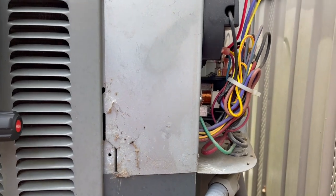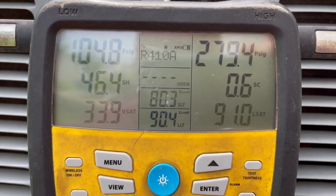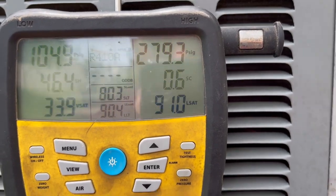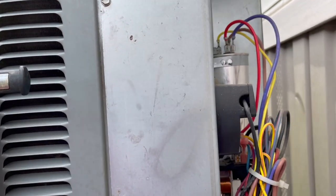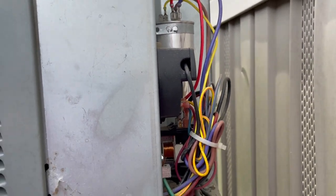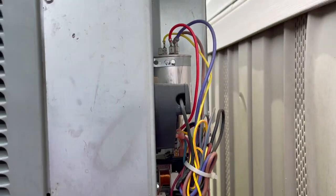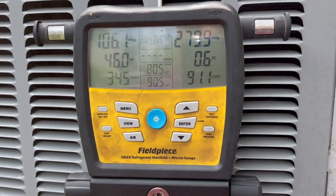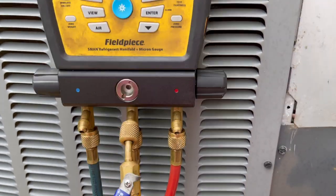The machine is running. We're a little low on gas. You can see we've got high superheat, no subcooling, and low suction pressure. I'm going to check that capacitor because it is a Chinese capacitor. This is a 2016, so this unit's about five years old, so that capacitor is probably on its way out. And we're going to gas it up and scan the evaporator for a leak.